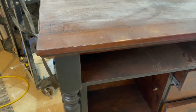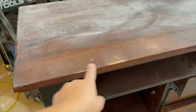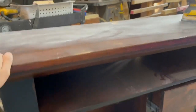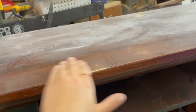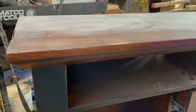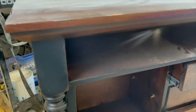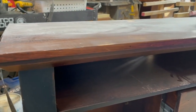I wanted to give you guys a little bit of a close-up. This area here has not been sanded and the top has, so you can see this area is not as shiny — it has a little bit more of a clouding effect because I've sanded down the original top coat or finish. That way my paint is going to stick a lot better to this surface than a shiny surface. I know there are paints out there that say you don't need to prime or sand, but from personal experience, with the paint I'm going to be using, I am sanding everything down and I'm going to be priming it all.